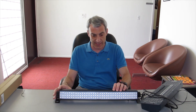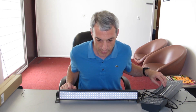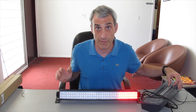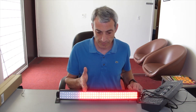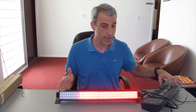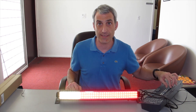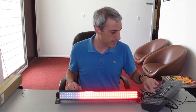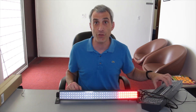I'm going to quickly change this over to 12-channel mode. Now in 12-channel mode, channel 1 is the red for just the first section; channel 4 is the red for the second section; channel 7 for the third; and channel 10 for the fourth. So I actually have four different segments — I said three earlier but it's four separate segments you can control. You can turn one off, change colors on another, and it gives you full control. That's the difference between the 8-channel and the 12-channel modes.